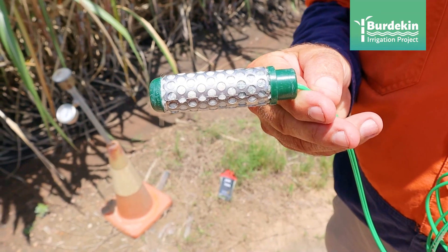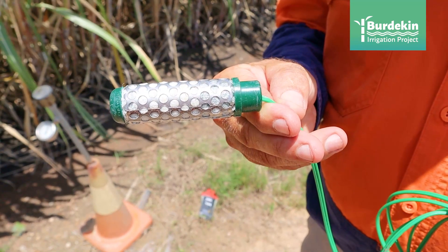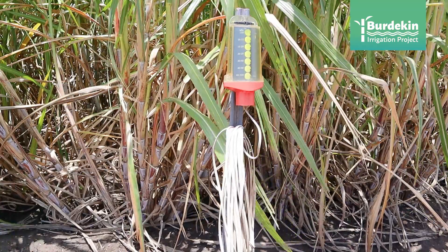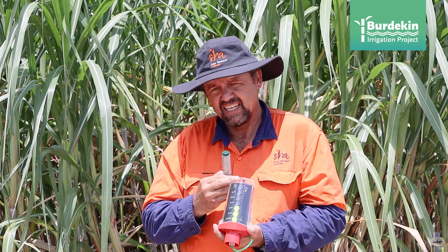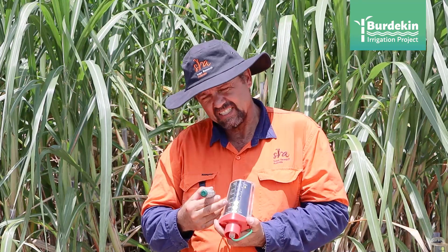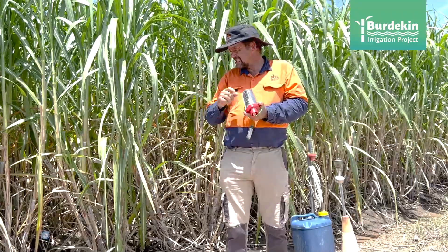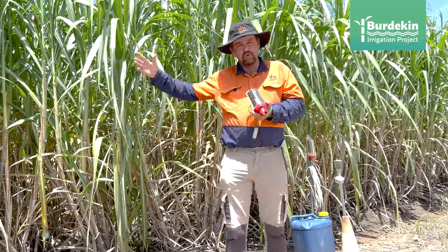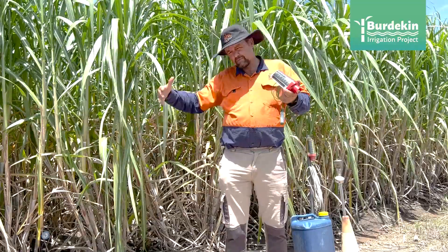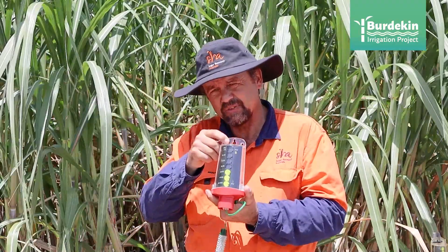The device works with this block taking up the soil moisture and getting in balance with the soil moisture around it, having a specific resistance. With that soil moisture decreasing, the resistance to electricity increases and that's then translated into these yellow dots. When the soil is wet all dots turn yellow, and as the soil dries out one by one turns black — that gives you an indication of how the soil is drying out. The difference from the tensiometer is that the tensiometer has the pressure gauge at the top, and if you put it into the fourth row of the block — because you don't want it on the outside row affected by wind and other circumstances — you have to crawl in there every time to measure, whereas the G-DOT has the display unit on the outside.